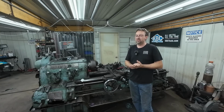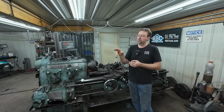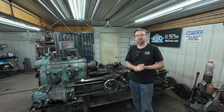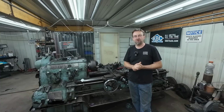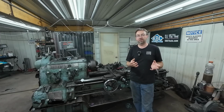So this coming Saturday, the video is of the bushings that go into the wheels that the shaft supports. So that will be the next job. We'll make all the bushings. Those are going to be Nylotron. And before anybody comments, why aren't you using bronze? Well, bronze is expensive. Nylotron is not. Nylotron holds up just as well as bronze in a lot of applications.